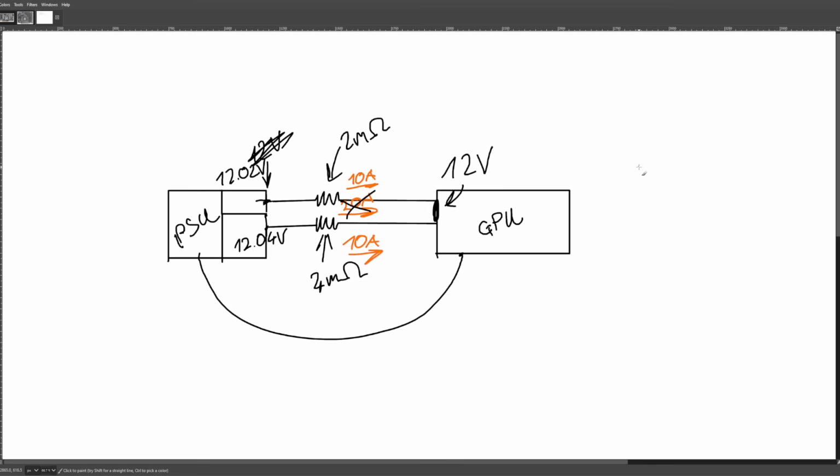The thing that's insane to me is this is a piece of plastic. The connector is just a bit of plastic and some metal. Why does it need to be so close to the limits? You could just respec it to 300 watts and put 2 of them on there. And I guess NVIDIA's problem is, oh, but then we'll need current balancing. Just respec it to 300 watts with a momentary overload of 600. There. Solved. 300 sustained, 600 watt peak, and then you don't have to worry about making all of your current balancing super fast and accurate. Which is basically how old AMD GPUs and old NVIDIA cards work.